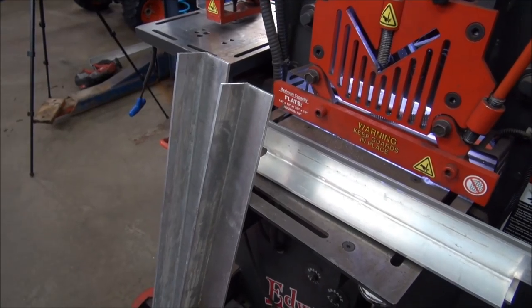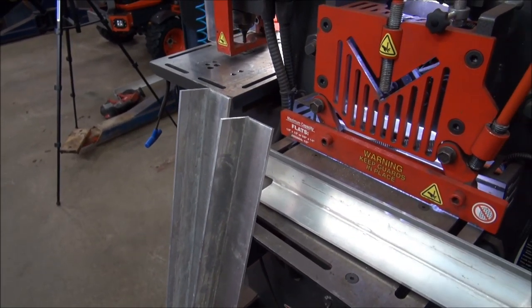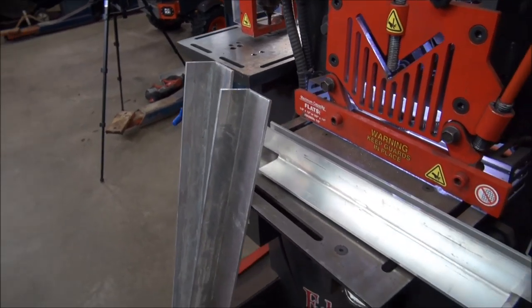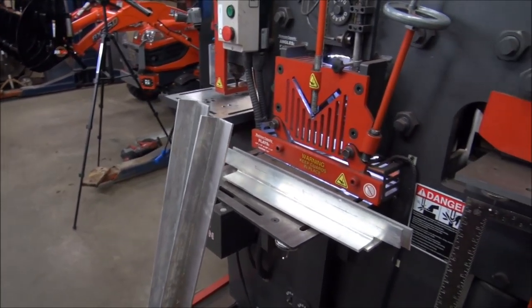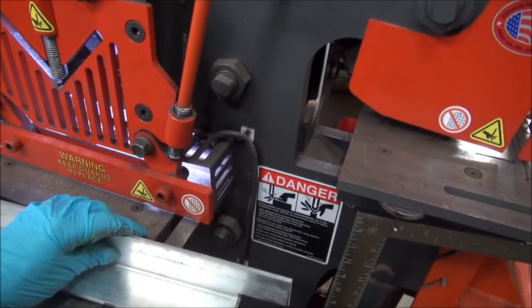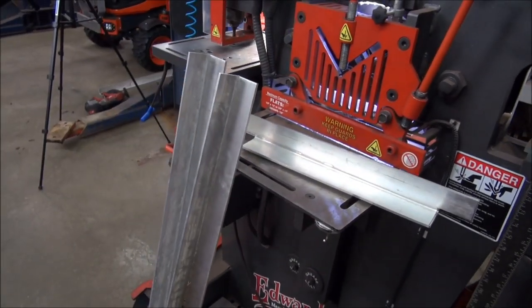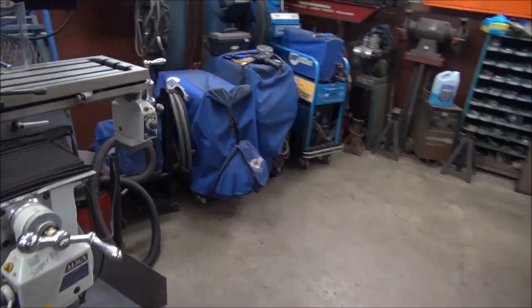It's like, I got a friend of mine, he's a carpenter. He was talking about measuring twice and cutting once, but he told me he worked with a fellow one time that said he had a piece of 2x4, he cut it twice and it was still too short. So much applies to this. So the best thing to do is, anytime you got a notch angle iron or whatever, make sure you notch the shortest piece.